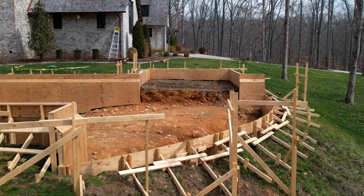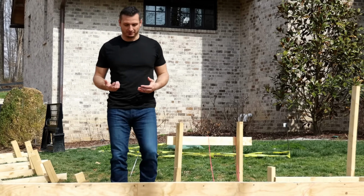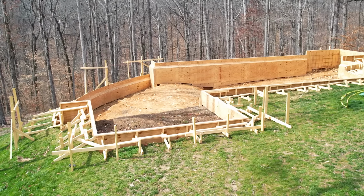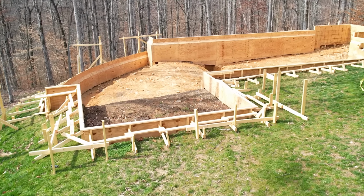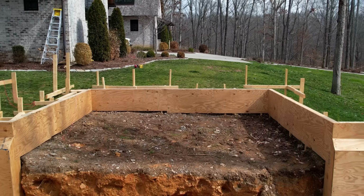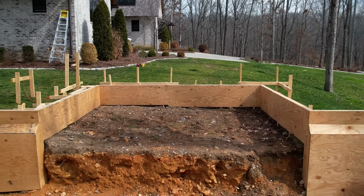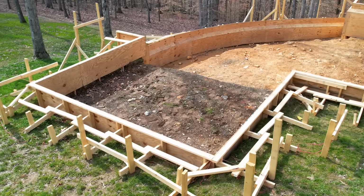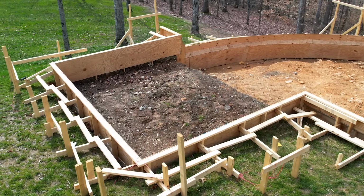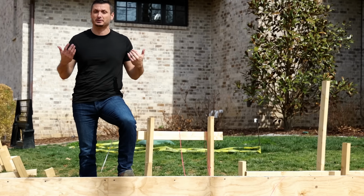So over here, we've got our Cabo Shelf or Kitty Ledge or Tanning Shelf. This is called many things, but ultimately it's a shallower zone that is multi-use. One is we can actually set chaise loungers in here. Now you're going to see that this is vastly oversized at this point in time. When you're building these shelves, you want to make it at least about 6 foot wide, because if you think about a chaise lounger, they're about 6 feet.